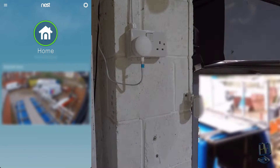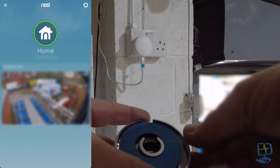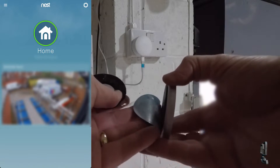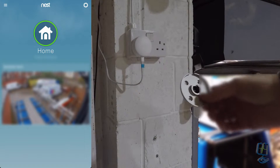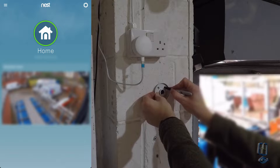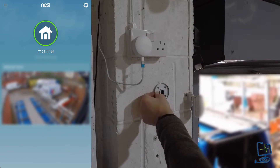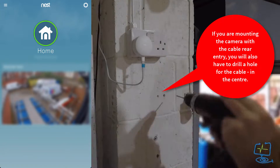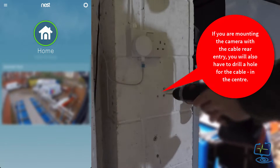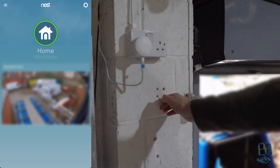The first thing you need is your back plate — take the blue protective stickers off as I showed earlier. Once they are removed, find a suitable position for your mounting holes and make sure you get a good fixing. I'm doing it with the cable entry to the bottom, but you can route yours to the top if you're going up into the eaves. Find the four holes, mark them out with a marker pen, then pre-drill them ready for the rawl plugs.